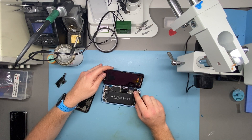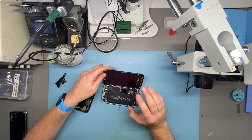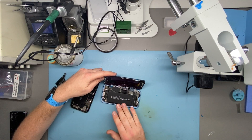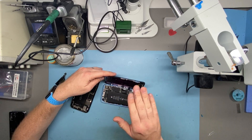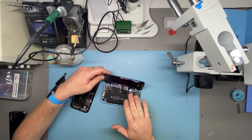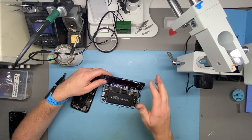The IC on this screen is from a Toshiba-paired logic board, and I've moved the original IC to this screen. This IC does not match either of these phones. Both of these phones originally had LG DTP C3F screens calibrated with them. This is a C11 F7C screen — I've moved the IC over to this screen for the repair of a completely different device, but I want to show this screen working on two LG-calibrated devices to show how the screen behaves.